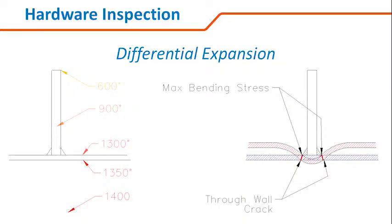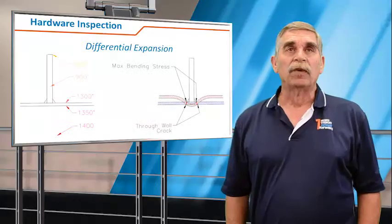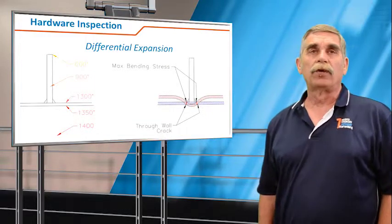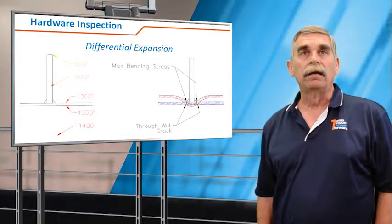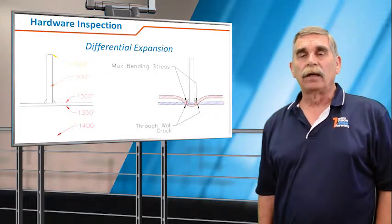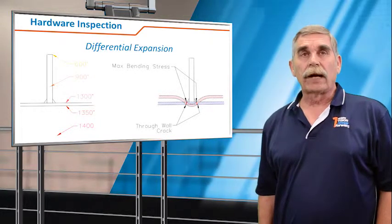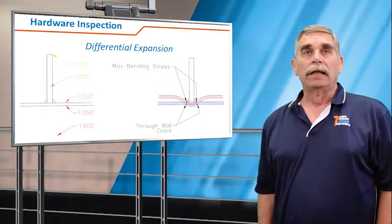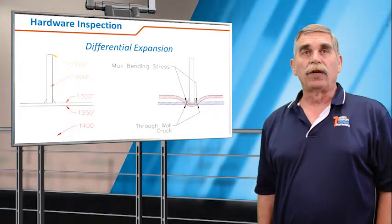One of the things we're especially keen on is rings on large diameter piping. This picture shows if you were to do a temperature profile of a 1400-degree expander inlet line, the temperature on this ring would substantially reduce. These are actual field measurements where the media was at 1400°F and the ID of the pipe dropped to 1350°F.